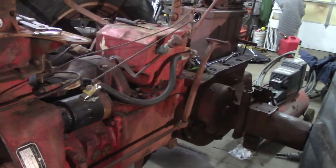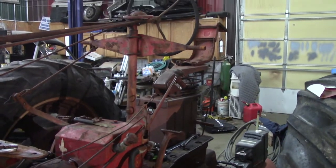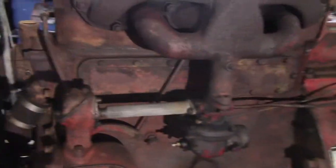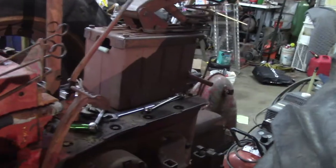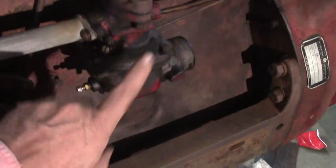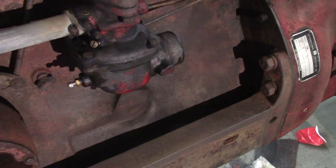You run into money with diesels no matter what you do. But I liked this tractor - it didn't run when I went to buy it, but everything checked out pretty nice. It spun over nice and I could tell the battery was dead. Somebody had evidently tried to fix it. First thing we did of course was drain the carburetor - old gas just wouldn't fire. We put fresh gas in it and within a half an hour we had the old girl running. Then we were driving it around a little bit - I have a video I'm gonna put up with that too.